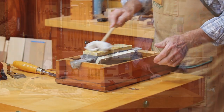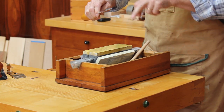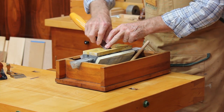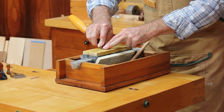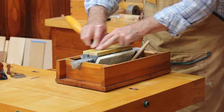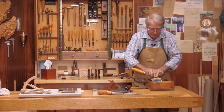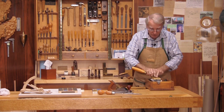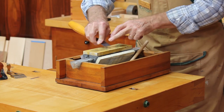I have this water pond — simply make the stone wet. The chisel has been hollow ground, therefore it has two edges. I hold it right there, push down low on the end, and start sharpening. Keep doing this, push hard, and use the whole stone.